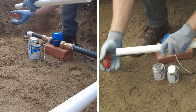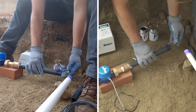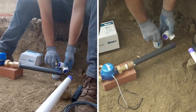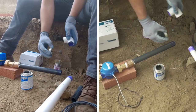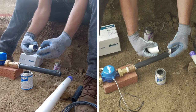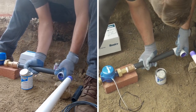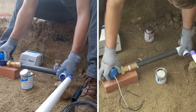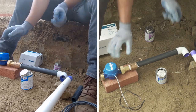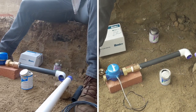It is best practice when making any mainline connections to use both PVC primer and a medium to heavy body PVC solvent cement. Prepare the pipe and fittings with PVC primer. Apply a generous amount of PVC solvent cement to the mainline pipe as well as the inside of the fitting. Slide the fitting onto the piece of pipe, pressing firmly and giving it about a quarter of a turn to make sure the solvent is evenly distributed in the fitting. Hold it firmly while the solvent sets — at least 30 seconds, but follow the instructions on the back of the container. Wipe away any excess solvent and follow the same process for the second connection.